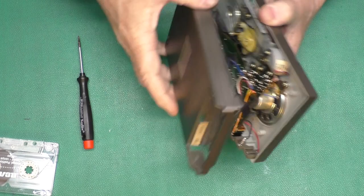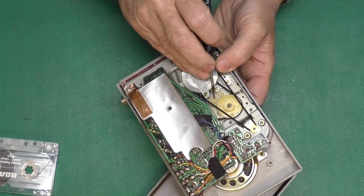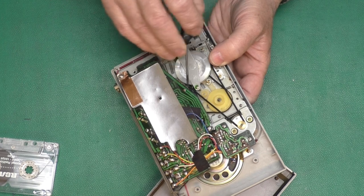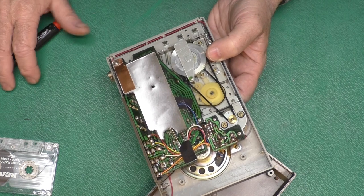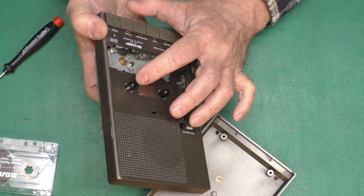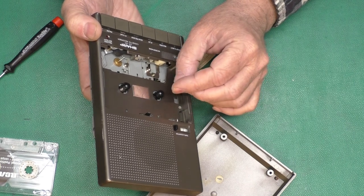And that's this little sprocket right here. What was happening is when that was being pushed up, it was being pushed up into the bottom of this idler wheel right here, which then caused the gear to run backwards. Now, how weird is that? Once I figured that out and I was able to hold this part and push that back on there, then everything was fine. Before pushing that back on there, I glued it with some super glue and let that set for a while and pushed it on there, and it seems to be fine now.